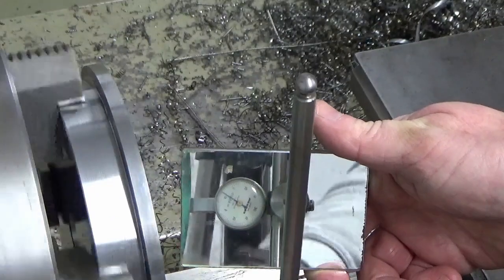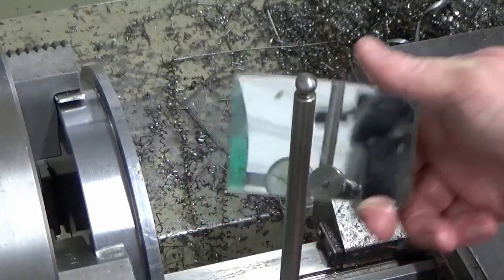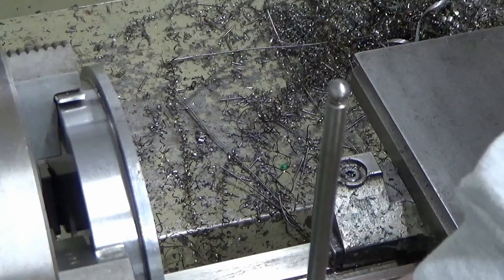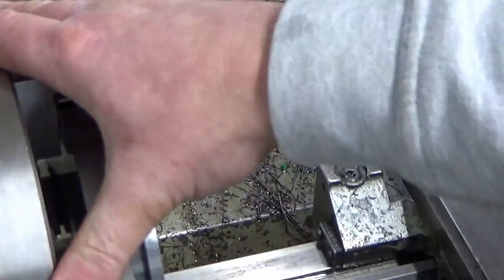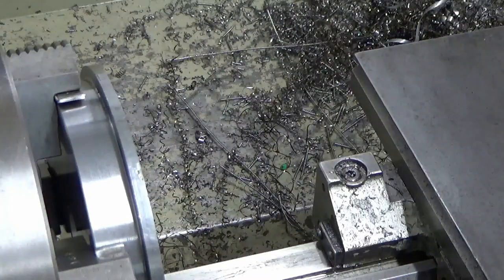So there you go, we're about 2 or 3 tenths of a thou that way, which is 5-7 microns total at its very worst, about 7 microns, and my tolerance is 13, parallelism wise, so happy with that, that's all set up, we're all tight, good to go. I'll bring you back now, we'll get some tools set up and we'll start machining the front side.